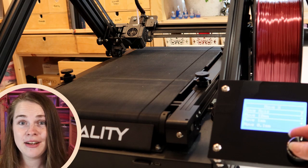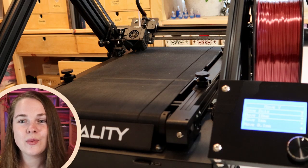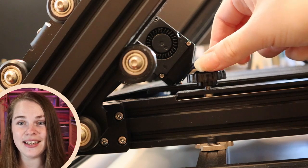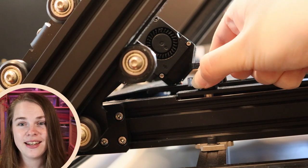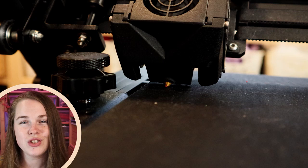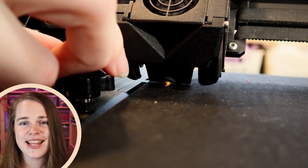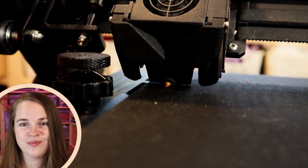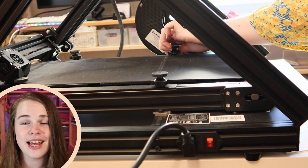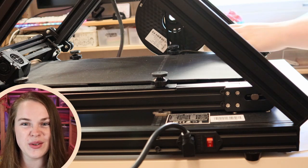Once you've got it in that corner, you'll want to level that corner too — bring the bed up so it's just touching the nozzle, then lock it in with the nut. Slowly bring that bed up until it's just touching the nozzle, make sure it's just right, and lock it in. These other knobs at the front control the height of the secondary bed at the front, and you just need to make sure that bed is touching the belt — just fiddle with those knobs to make sure that's all hunky-dory.